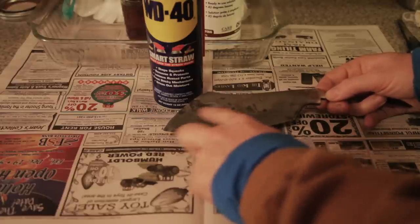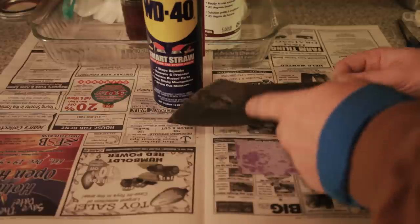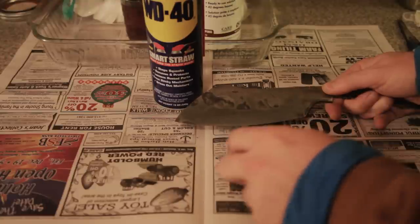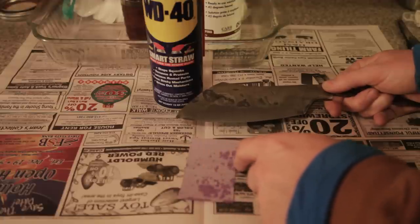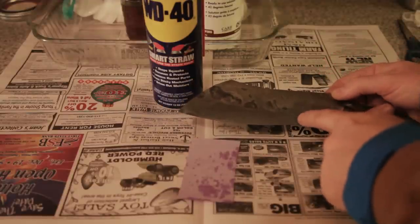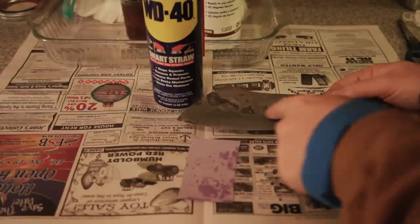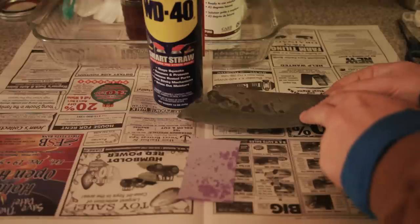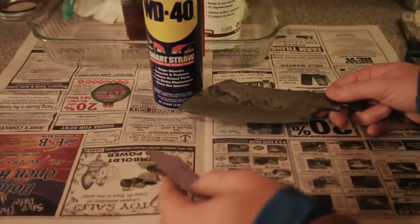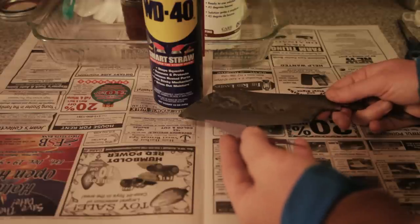I'll go from about mid-blade down rather than all the way up, because it's going to look rougher up there and I kind of like that. The crucial part is that transition between the super-hard steel and the soft steel. I'll go from 330 all the way up to 1500 grit and then redo the etch. Why hand sand? Because I don't have belts that go much higher than 330, and if you use a buffer it rubs that hamon line out and you can't really get it back. Since this is a convex edge, I can't use a sanding block — it's literally fingers, sandpaper, and a little WD-40.